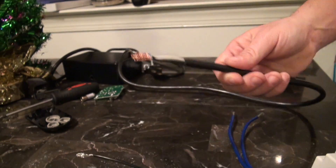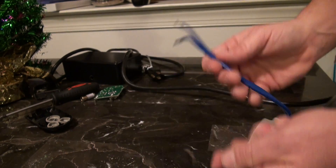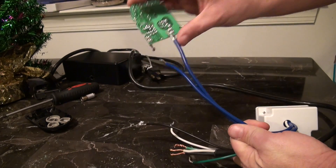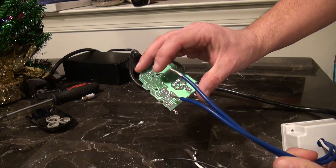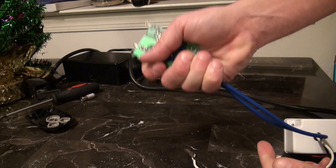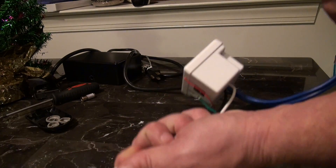I'm not very good at this stuff and I'm able to pull it off, so you should be able to pull it off too. That's going to give you the power. This is going to give you the controller. These two blue wires — that's what's going to go to this little garage door opener circuit board, those four leads to that middle button. That's going to open and close the garage, and that's going to give the relay power.